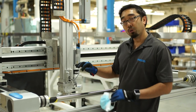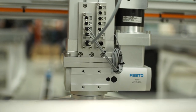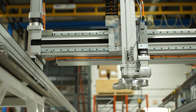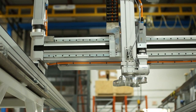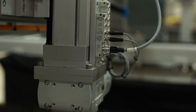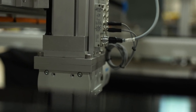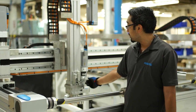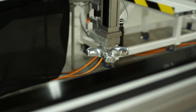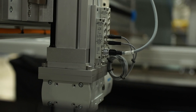The last actuator on this four-axis gantry system is our electric rotary module, the ERMB. This has infinite rotation since it's electric, and this will be the interface between our gantry system and the customer's end-of-arm tooling. It's powered by our EMME motor. We also have some I/O modules here, which allow the customer to connect various sensors to these blocks and run just one cable through the cable track back to the panel, simplifying the cable management system.